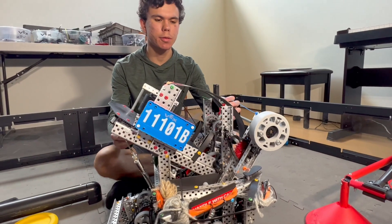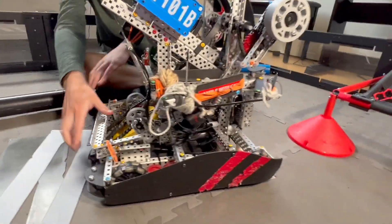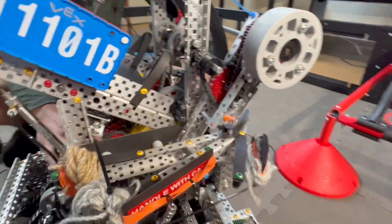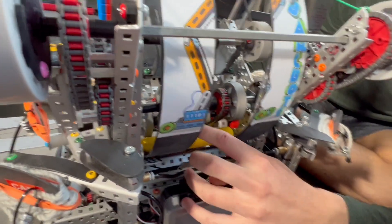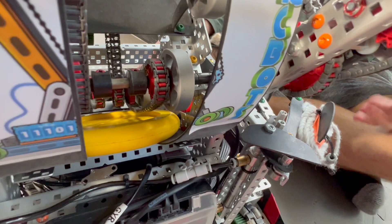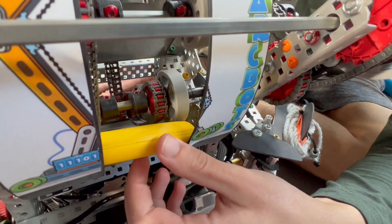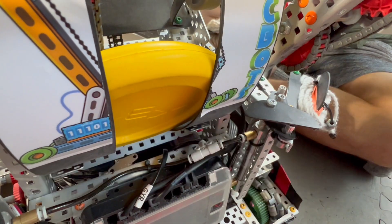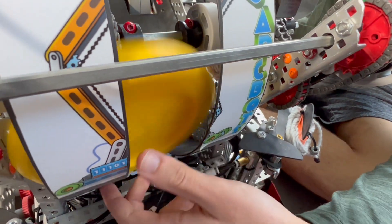The critical thing with the snail is — as I said before — the disc needs to go smoothly. The disc has a lot of room and space to do whatever it wants. As you can see, the disc is not contacting this set of flex wheels after it exits. This is not a problem because when you're intaking the disc at full speed, there's enough momentum to push it up to the stage. The amount of friction and resistance to changing angle is very, very minimal, especially at the bottom.